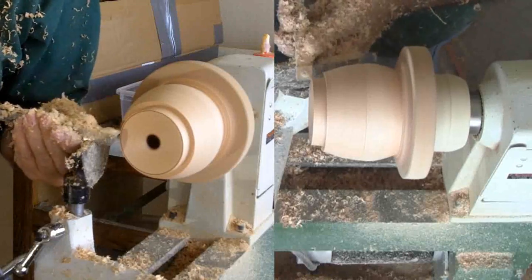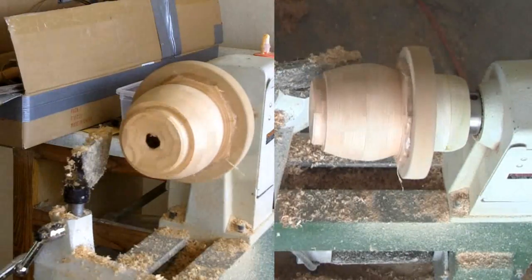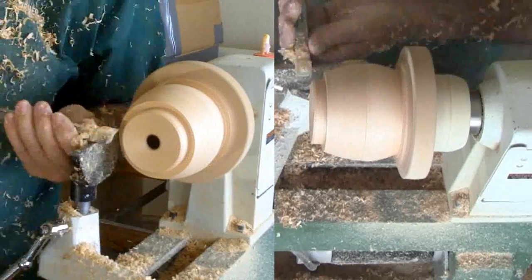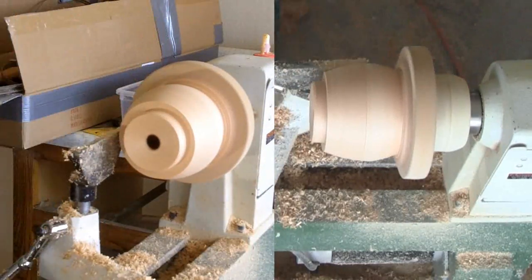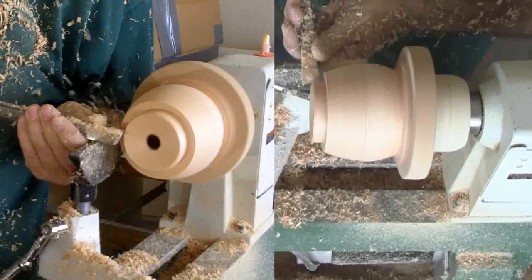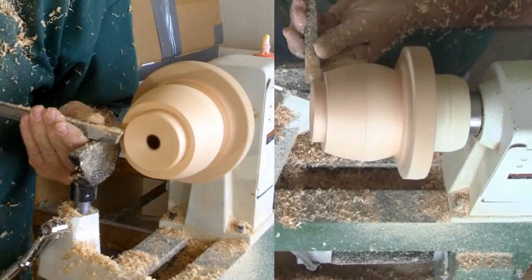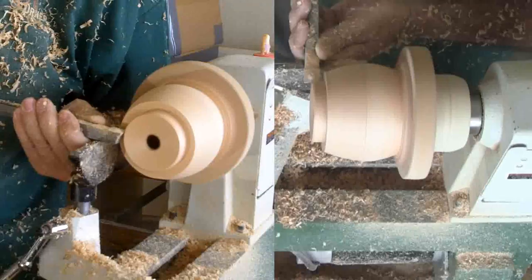Easy does it — I've messed this up at this stage before. I cut a chamfer on the end, test the fit, cut away the tenon to most of the chamfer, then repeat until I get the fit I want. I don't want it super tight nor sloppy loose. Loose enough to require a paper towel for a tight mounting fit is about right.